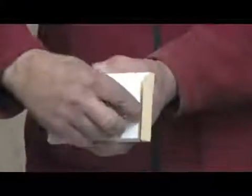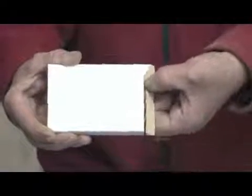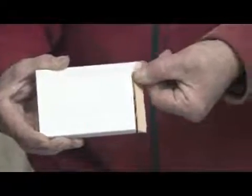First, on your inside piece, make a cut of 45 degrees. And what you see of material there, that 45-degree cut, that's what has to be removed for the cope to work correctly. The next thing, we're going to make a cut with our chop saw, cut out the meat section of the actual material, and then this upper lip here is what you're going to use your coping saw to cut off. That's how I got the name cope molding.